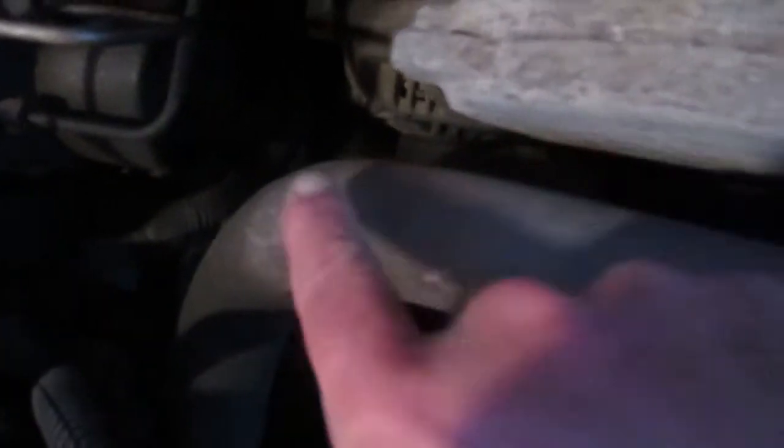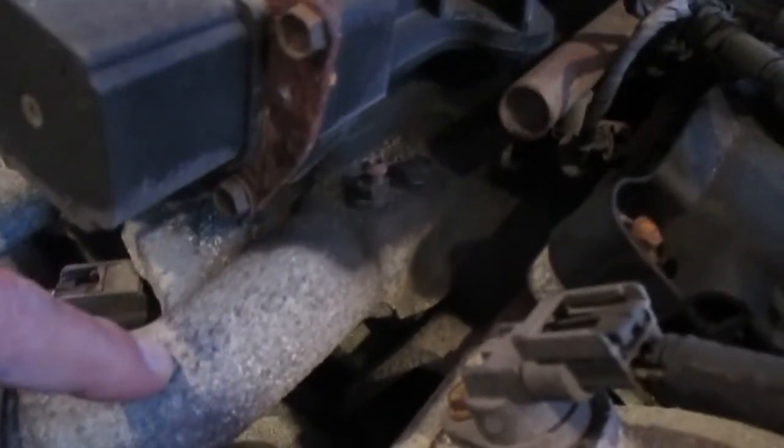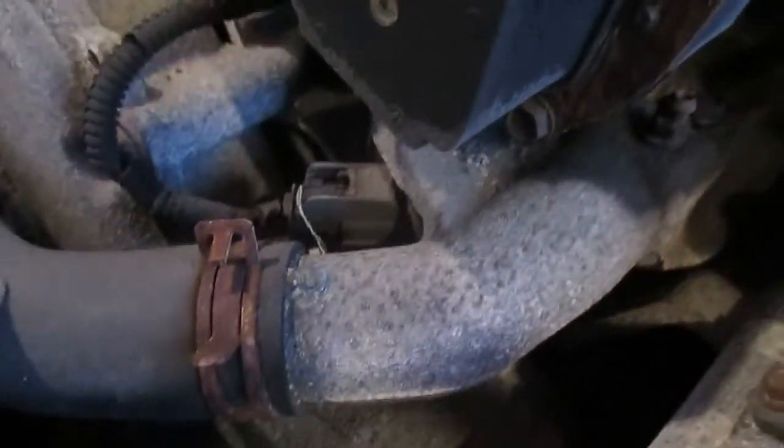The vehicle we're going to do our temperature check of the thermostat on is a 2007 Chrysler 300. Here's our hose to the radiator. So the coolant is in the radiator here. We follow this hose up. Here's our thermostat housing in here. So the thermostat itself will be in there, and we are going to just put our temperature gauge on the radiator hose anywhere along here.